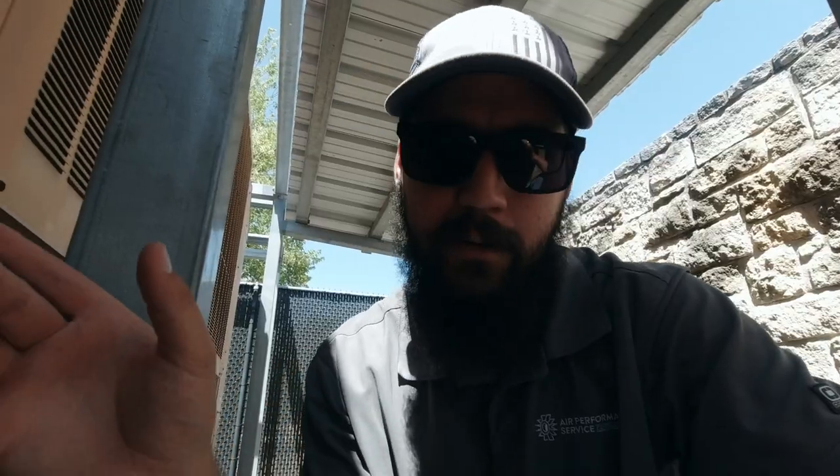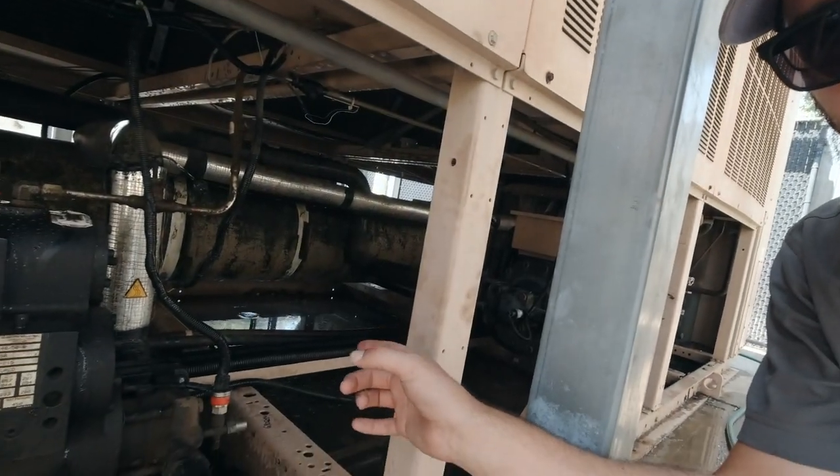We had a pretty significant leak for over a week on that discharge line — that's when it popped up. What that means is at some point someone overcharged it, not sure when or why. After startup and finishing this piece of the video, I'll include some tech tips on the recovery and the subcooler process. We're actually here because the discharge line had a leak at the gasket.